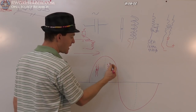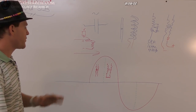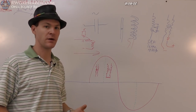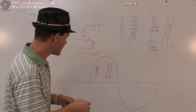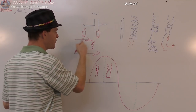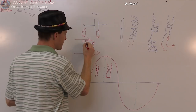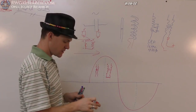On the second part of the cycle — or a quarter cycle — we connect it so current flows up to the peak, then we can charge this coil and discharge it to produce a magnetic field. This simple thought process brings you to realize that you can use the magnet being pushed into this coil to generate a potential, then use that potential to generate a magnetic field. When the magnet is on this side you remove the counter-EMF and have an open circuit, basically charging up the internal capacitance.